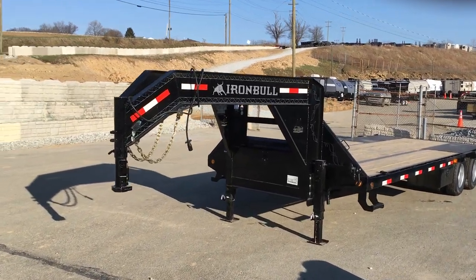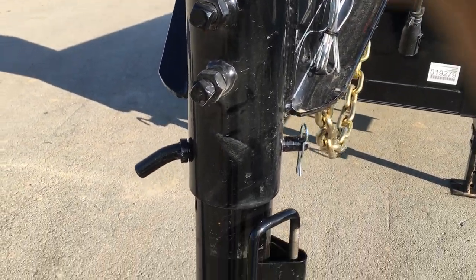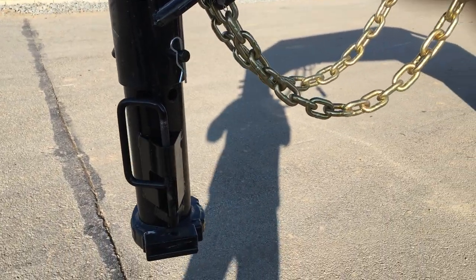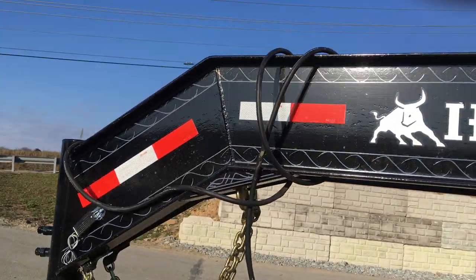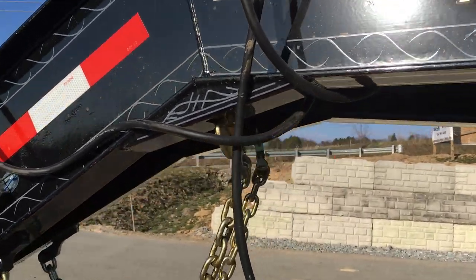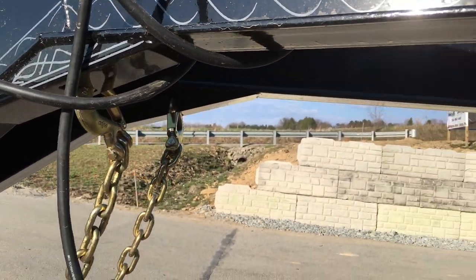Up front it's got a standard gooseneck coupler with safety chains and breakaway. It's got your set bolts on the neck with an adjustment of four different holes — right now it looks like it's got one hole out. If you're not familiar with the gooseneck coupler, it's a spring-loaded setup. It's got a sealed wiring harness. You can do a full seam weld inside and out on the neck, and you can do an under-neck bridge — actually a neat fabricated part underneath the neck. It's an integrated safety holder that also gives structure underneath.